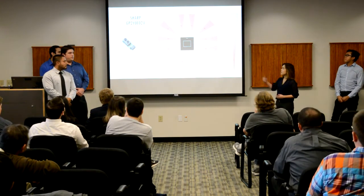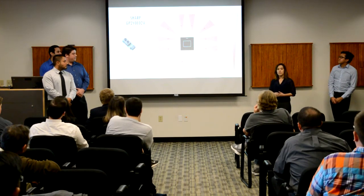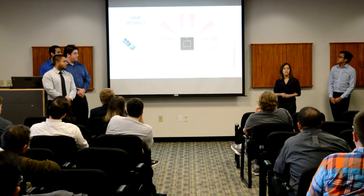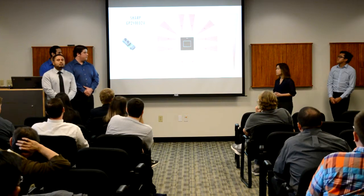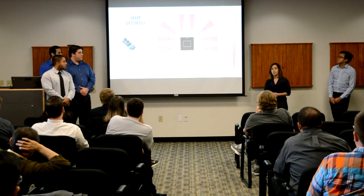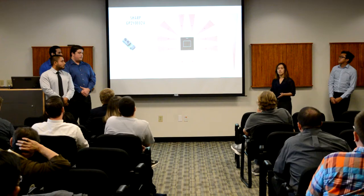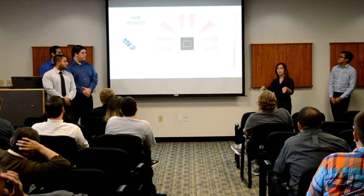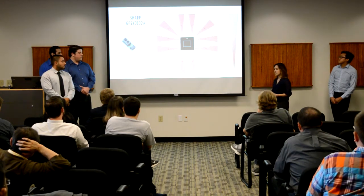We also have this diagram that represents accurately about how much we're able to see. Our sensors were able to have a 270-degree visual range of the arena, where our visual distance is about 20 centimeters. You can see that we do have blind spots, however, this is pretty much negligible due to the fact that we're constantly roaming. In addition, to maintain a sensor location within the ring, we have angled the sensors downward at 63 degrees. This not only allows us to detect the opponent, but also detect the surface. So we're able to detect a voltage change when we get close to the ring edge and then maneuver back accordingly.